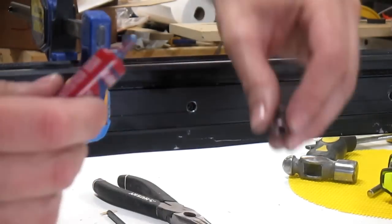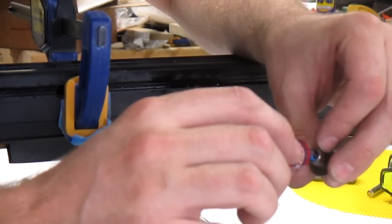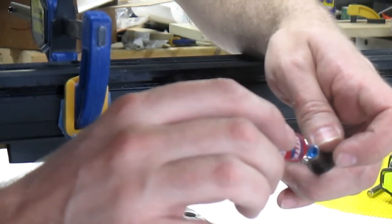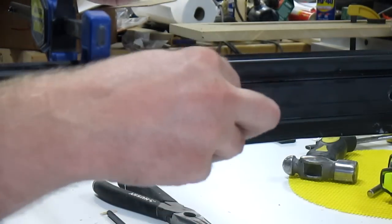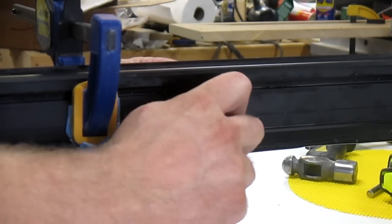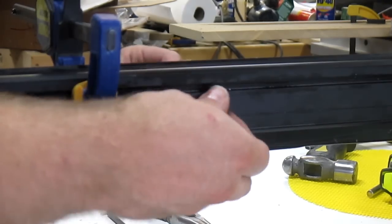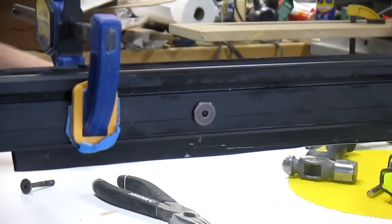Now the work is nearly done — it's time to put everything together. I installed the front maker slide, loosely installed the rear maker slide, and clamped the steel between them. I made sure the steel was level with the top of the maker slide, and that the maker slides were level with each other. Then I added a couple drops of thread lock to the furniture nut and loosely threaded each nut and bolt together. I had designed it so the furniture nut went in the back, just so I wouldn't see the shiny cut end of the bolt during regular operation.